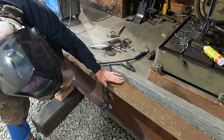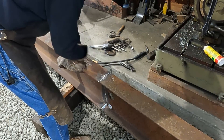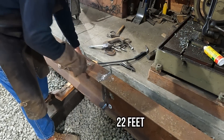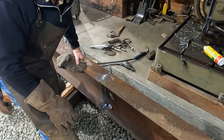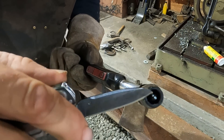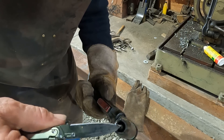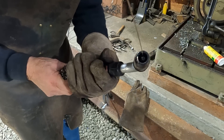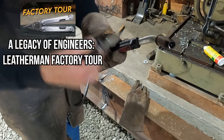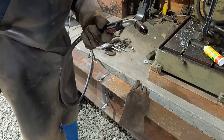That little corner's down a little bit, but I just don't care. Everything else seems to be straight from the 14-foot piece to the center of the bow, straight for the 26 feet on the other side. I'm going to weld this off hard and then figure out how to take that bend out. My wire feed was messed up — I've got a BB stuck right there putting friction on the feed. Didn't keep the nozzle dip on there. Smooth as silk. Leatherman to the rescue — cut it off, back to the nozzle dip, full speed ahead.